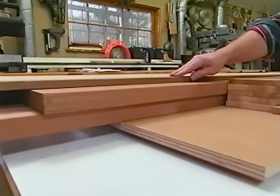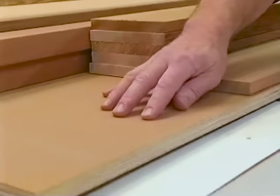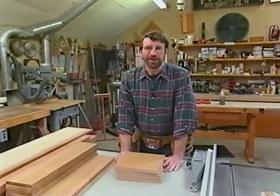The materials I chose for our grill cart are redwood and cedar for the solid material — good choices for outdoor projects. They can stand up to the weather, they don't rot easily, and they're pretty insect resistant. For the substrate of the top, I'm going to use MDO plywood, three-quarters of an inch thick. It's what they make highway signs out of, so it really holds up to the weather. A measure drawing is available with the materials list.